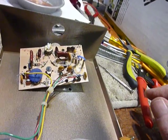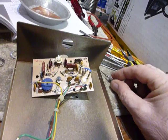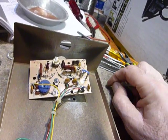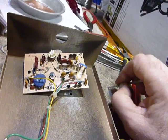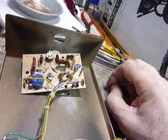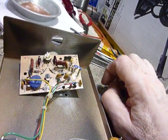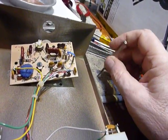I realized it's not wired for HF. This particular wattmeter/SWR bridge can be wired for two meters and six meters. So I started checking parts — there are nine parts for each band — and it had the nine parts in it for six meters, so I had to pull all those out and look all over the place to find the right parts.